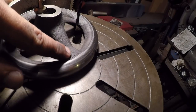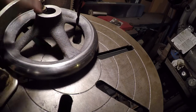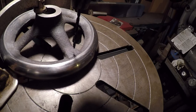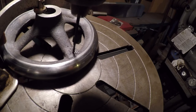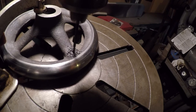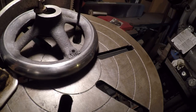In the pattern I actually put a center point when I filled the hole in the original casting, so that's handy — I know right where I need to drill my hole and the drill bit shouldn't wander. We're going to go ahead and drill an 1/8-inch pilot hole and then jump up to 5/16ths. Then we're going to have to counter bore it, although I don't have a counter bore, so we're just going to have to use a little bit larger bit. All right, that's all the way through on that one.